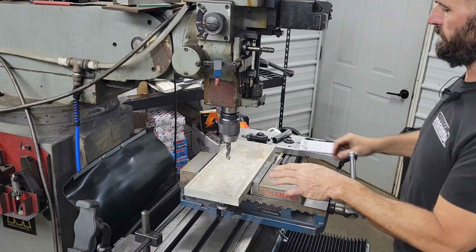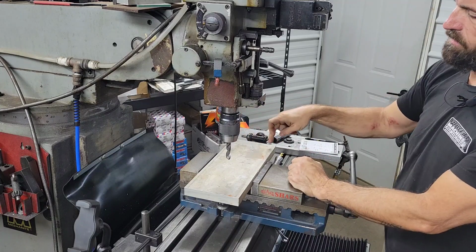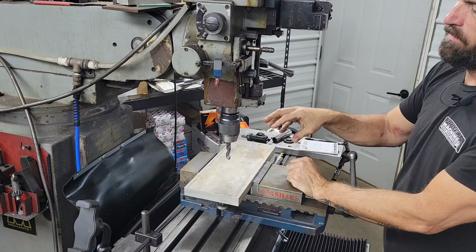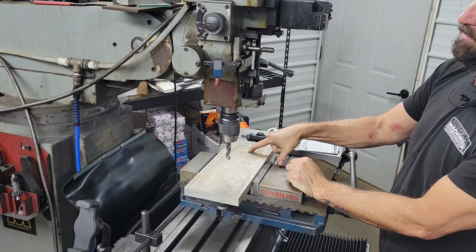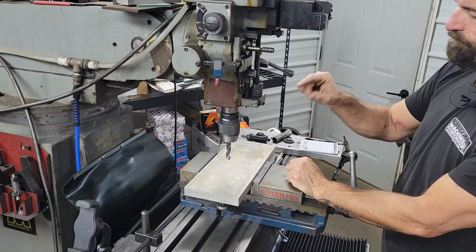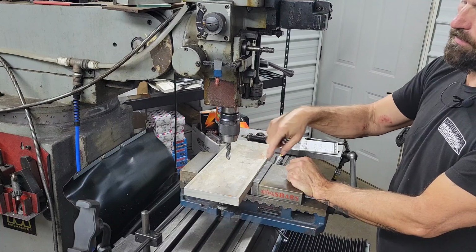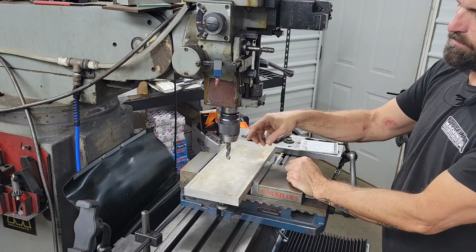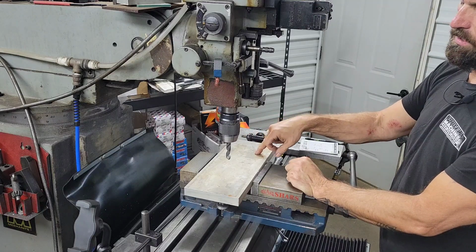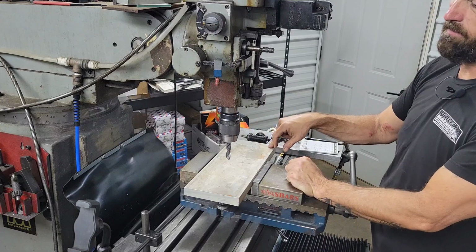All right, so we got to put two bores to clear the sleeves, and then we're gonna put a bolt pattern in it to bolt it down. So we're gonna drill us a clear hole in the center of each bore, and then I'll swap tools, come in with a roughing end mill, and then we're gonna circular interpolate two circular pockets through for the sleeve, and then we'll swap back to drills, and then I'll drill and tap the 4 holes.